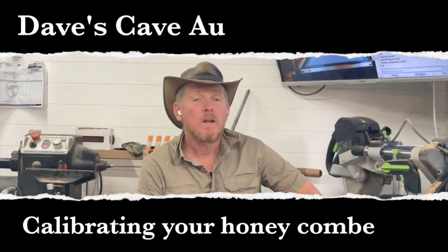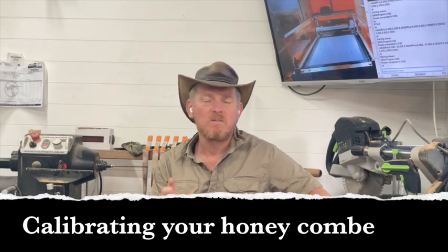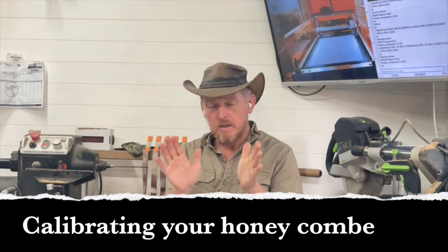So in this episode, we're going to have a look at calibrating your honeycomb for your laser. And when I say calibrating, honeycomb doesn't need to be calibrated. But what I like is for my honeycomb to be in a very exact position so that I can use it as a definite reference when using absolute coordinates in Lightburn.